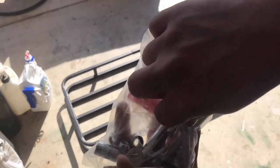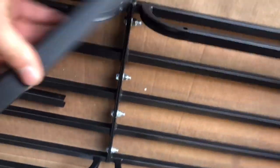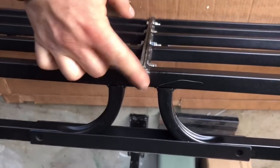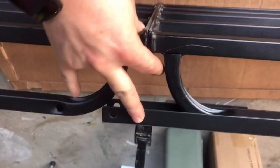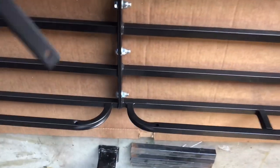And lock washers as well. Then we'll have to run to the hardware store and get some of these but shorter, so we can bolt the ones in the middle. We have the middle section bolted down, we're going to go ahead and bolt up these cross braces. They go across here, and in order to do that — because we're not going to use the center 2x2 channel tubing — we're going to not be using the original holes and be drilling our holes off-center on both sides. So we're going to drill two holes here and two holes back here, for a total of four.